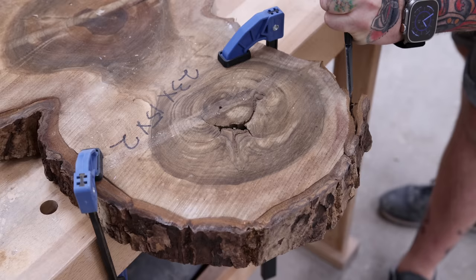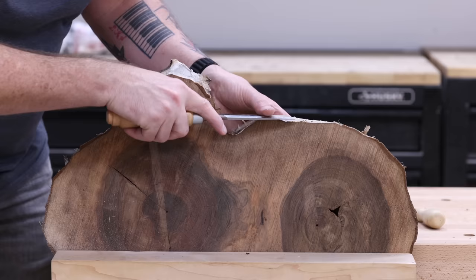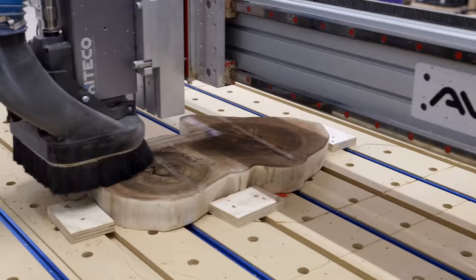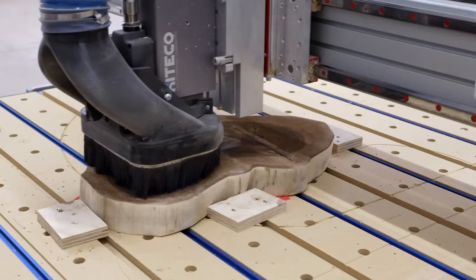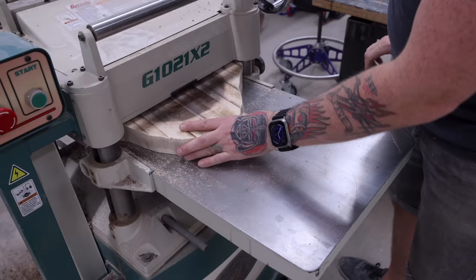The first thing to do is clean up all the bark around the edges. I'm always a little bit amazed by how many comments I get on live edge projects telling me that I should leave the bark on. I'm sorry, folks, but that is a terrible idea. The bark is eventually going to fall off anyways on its own and bark is rustic and unsightly. I ran a few quick flattening passes on my CNC and this slab is narrow enough I can run it through my planer to flatten the other side.